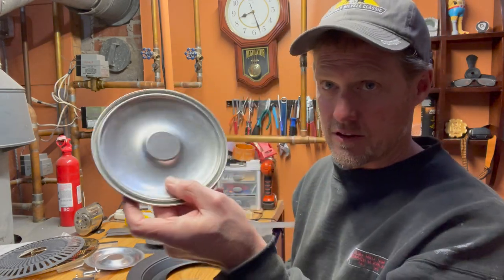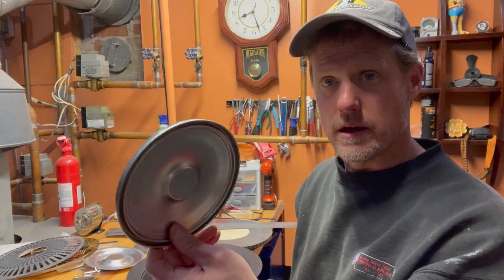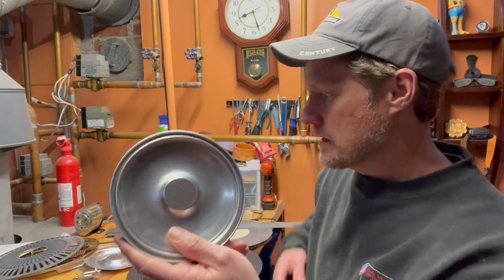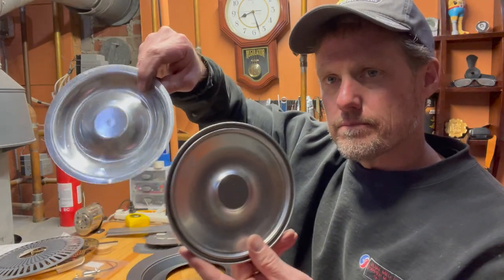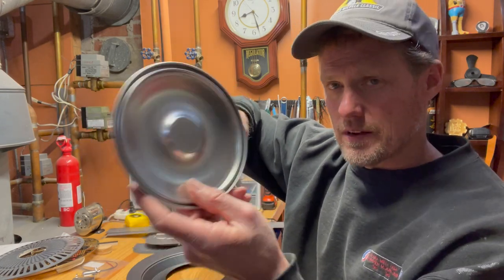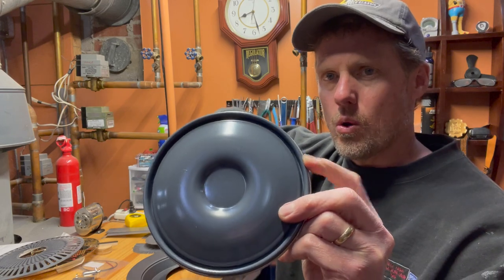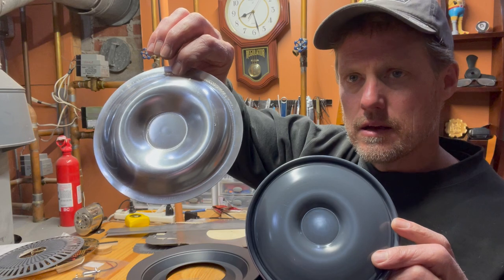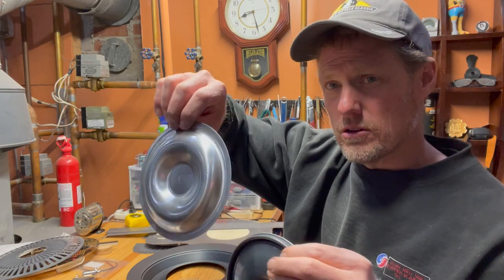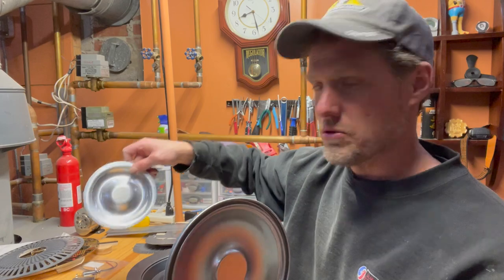There's another thing called a paint can lid resonator — literally a gallon paint can lid that folks buy in bulk, put on a metal lathe, and spin to form a little bridge. Compared to the 6-inch spun purpose-built resonator, the paint can lids are easy, cheap, and easy to come by at only $8. But the flange leaves a very small ridge, so you've got to be very precise when cutting the hole. The spun aluminum one has a little more room to adjust intonation. The ingenuity of the paint can lid is great though — I bought one anyway.